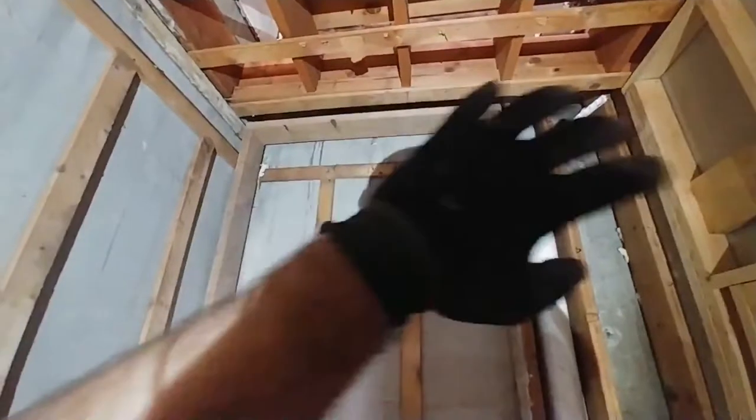It's a bunch of, don't judge me, this isn't my work. But we do have to do something productive. And so I'm framing all around. I left a little gap for his clean out. We'll get a wall underneath at a level that allows me to add some 2x12 up there and allows me to build a framed floor that's appropriate, at least over to this wall where it jogs out, which he was planning to skip